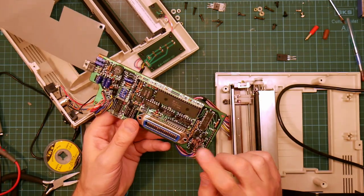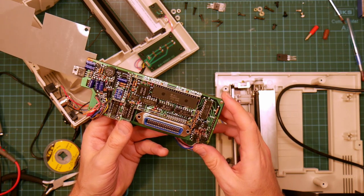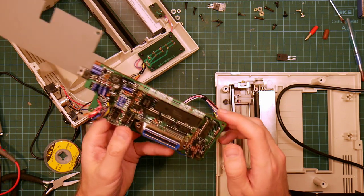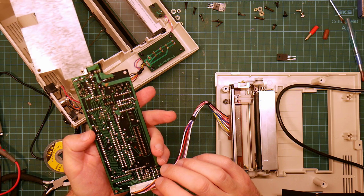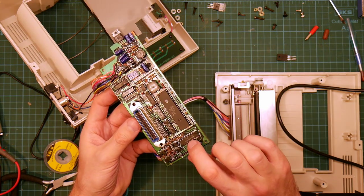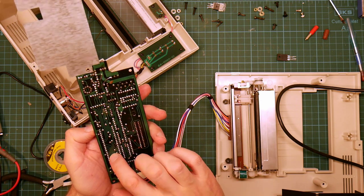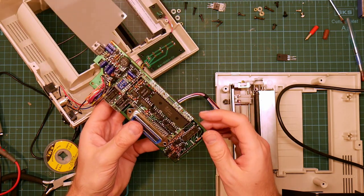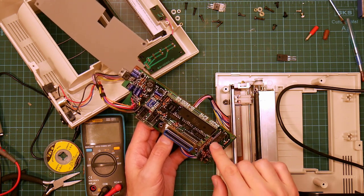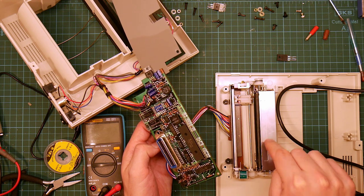I'm going to guess that this whole complex of transistors here is for driving the AC supply for the solenoid. I am not going to bother trying to decode it in any great detail. I know that bit worked, or at least it did, until I broke the voltage regulator. So the output to the stepper motors comes from this LB1257. This is then connected to the GPIO pins of the processor.